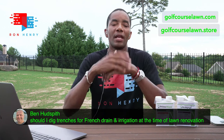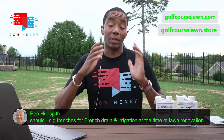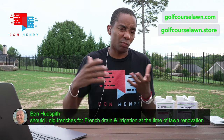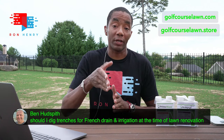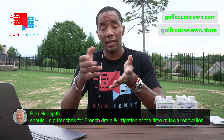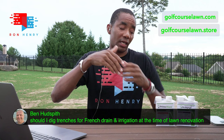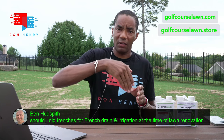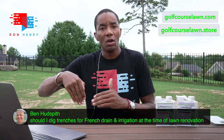Now for irrigation, it depends on what options you guys have in Australia. Here in Georgia, sometimes they will dig trenches, which is more the traditional way of doing it. Or they can use a vibratory trencher. If you saw the video of how Alex got the irrigation installed on his lawn, they used a Ditch Witch with a spine that went in the ground and vibrated, and they pretty much pulled the pipe right through the lawn.